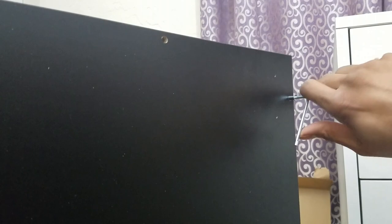They do give you an Allen key and long screws for this. My recommendation: secure four corners first — one, two, three, four — that way you can get everything situated and squared away. One screw is in; I'm securing four screws first so I know it's plumb and will go in without any problem. Connect one in the middle, one on the corner. Pro tip: you can move the unconnected bottom board up and down a little to get it flush and plumb. Once all sides are secure, you can put in the remaining screws everywhere else.